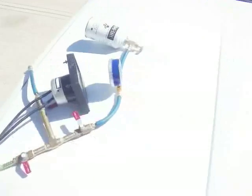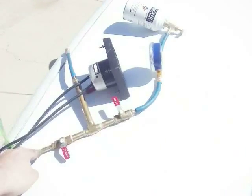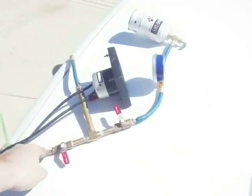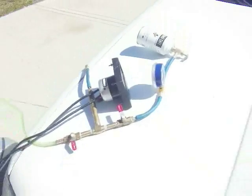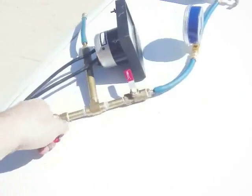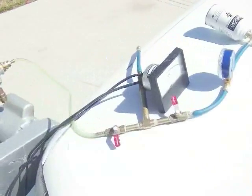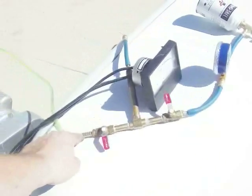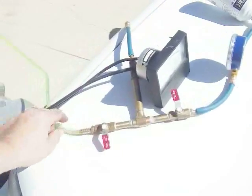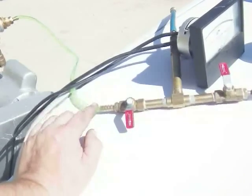Now that everything is finished, one more thing to note. As I was pulling a vacuum, some old refrigerant mixed with oil from the previous charge — which contained UV dye — got involved. I pulled the vacuum a little too fast; you want to pull slowly so the gauge doesn't rise too fast, because the oil mixed with refrigerant will boil and get kicked up. Some of that dye got atomized and blown through, and I'm trying to keep it from contaminating the vacuum pump. This dye is used to help isolate the slow leak so I can find and fix that part.